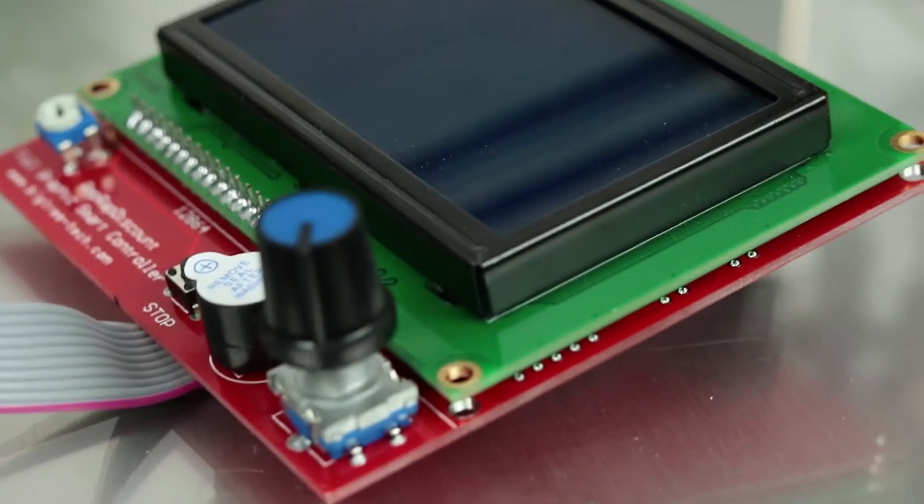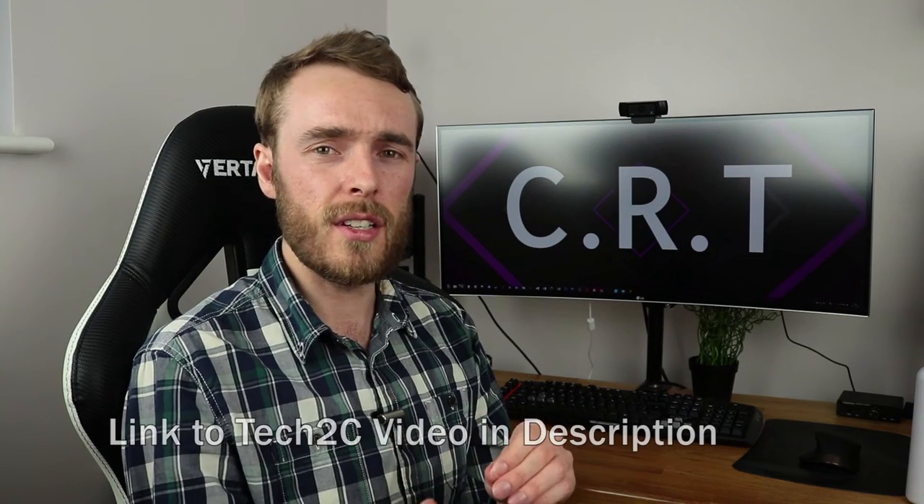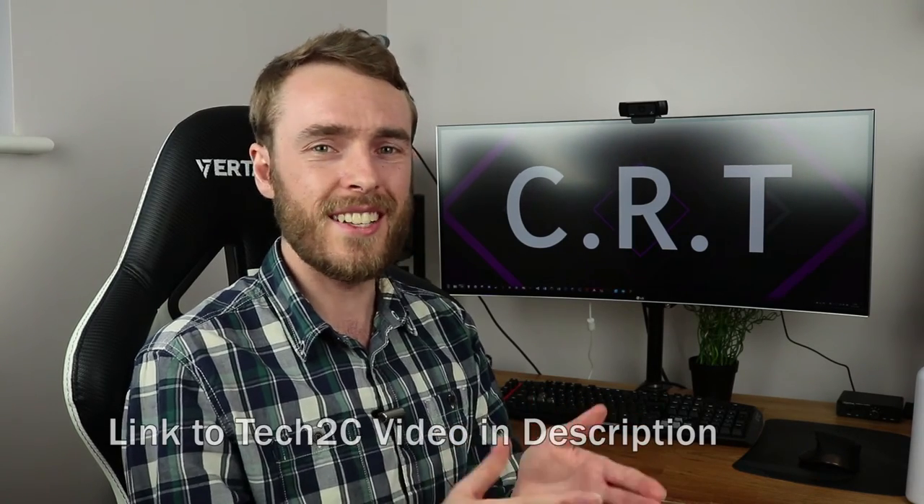To accompany the Ramps I have an LCD screen with an integrated SD card reader — the same one I have on my Prusa clone and probably the same on many other clone printers. It's a low-cost option but it works. At the moment I'm printing pretty much solely through Octoprint, but I've recently learned that the Arduino USB controller is actually very slow. Once you increase printing speed past 40-50mm per second, any curves requiring more computation end up stuttering and causing bad quality. So printing from the SD card reader is probably better until I get an upgraded board.